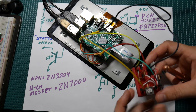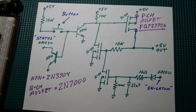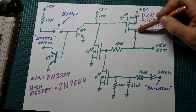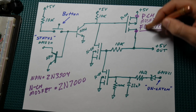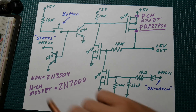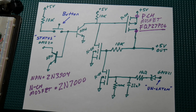Because these little breadboards can't really carry a lot of current, I soldered the actual positive wire from the wall adapter straight to the source pin of that P-channel FET, and from the drain I also soldered a wire that goes straight over to the GPIO header, because the Pi can pull up to two amps. That's why we've got it in a big TO-220 package — I've got the part numbers listed here for reference, and these are pretty common parts. The 5-volt wall adapter I'm using is running a little hot, about 5.2 volts, which is good because we'll have a little drop due to the RDS-on of this P-channel FET.